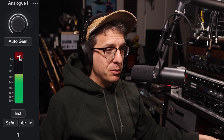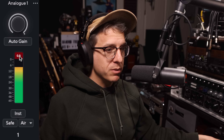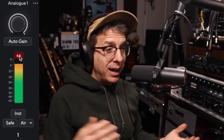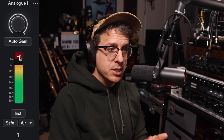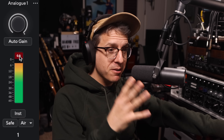I want to see how much gain we actually have on tap, so I'll increase my gain all the way up to 100. Speaking at a reasonable volume at a distance of two to three inches away, I am able to peak around -1 dB. If I get excited at all I can exceed 0 dBFS or hit 0 dBFS and clip and distort. So this thing has plenty of gain even for the SM7B without a Fethead or Cloudlifter.